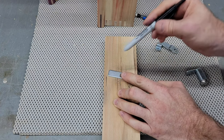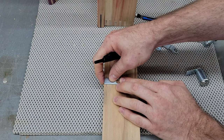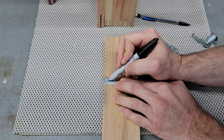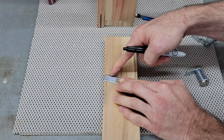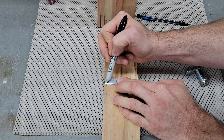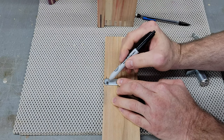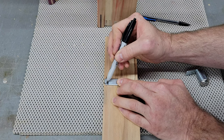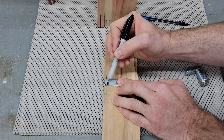I'm going to use a fine point Sharpie. With your line already on there and the center point for the cylinder marked, slide this up to the front edge — you don't want to go beyond it because then you'll have to grind some off. Go right up to the front edge and continue that line about halfway up, then come over and down. That's the area you're going to cut out to make the hook. Because this one is a little bit square on the end, I don't want that corner hitting first as it's closing, so I'm also going to put a radius on that front edge. Remove all of that material, and that gives you the right size hook to latch onto the mirror hanger. Keep in mind — because there's a little bit of play in the lock, don't grind all the way to the end of your cutout area at first. Stay back a little and sneak up on it little by little until you get just the right fit. Then use this one as a pattern for cutting the rest of your locks if you have more than one.